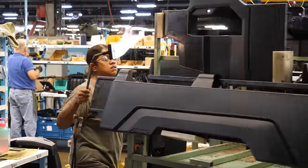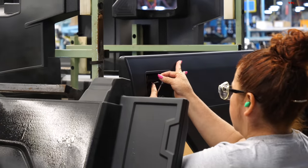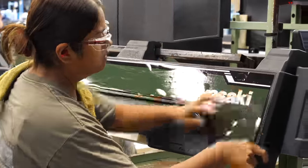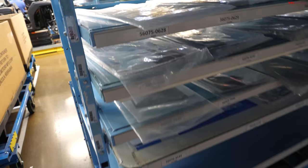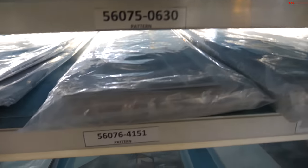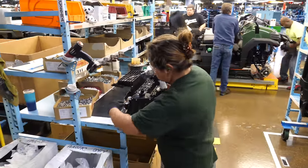She's actually heating up the plastics with this giant scary-looking blowtorch, and then on the other side they're going to start putting the graphics on. Door handles and latches get put on right here too, and once the plastic's heated up they give it a little spray down and put the graphics on — something tells me she's done that a time or two. With no bubbles in there, it happens very quickly. This rack has all the different decals laid out — all the different colors, engine designations, and different sizes are stacked up here, labeled with different part numbers so the people on the assembly line know exactly which decals to put on which vehicles.